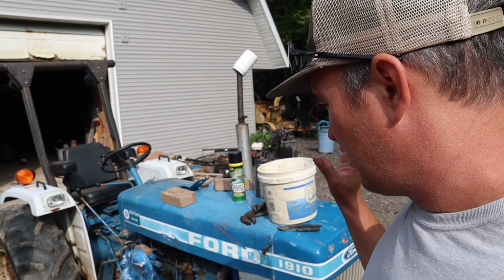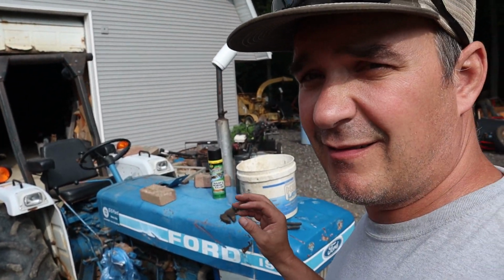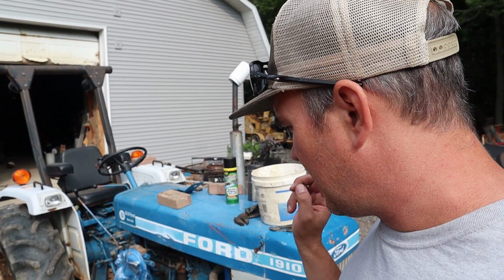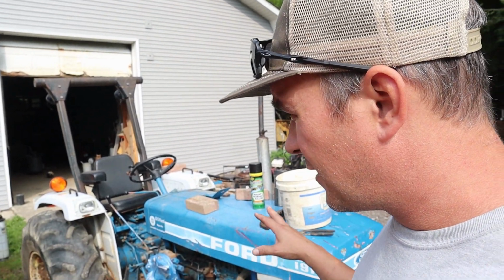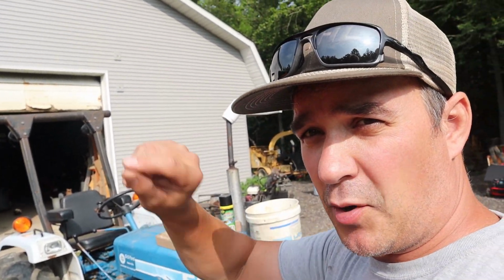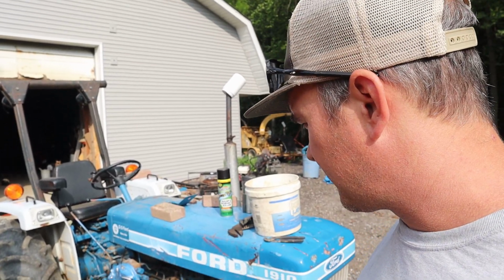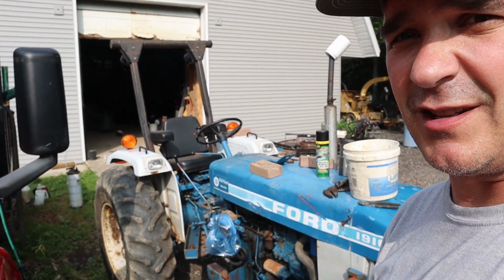All right, but what we're gonna get into today is I've gotten it to start off of ether, just because I wanted to make sure it turned over, and it can run till it's out of the ether, and then the fuel is just like trash. I siphoned out about a gallon and a half, 2 gallons already, but there's still a lot left in the tank, and when I'm pulling it up the straw, it'll change from like red to dark red brown. So all of it's coming off, and we'll probably have to order a filter, and then we'll try and fire it up again. So let's drain the rest of this fuel.